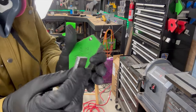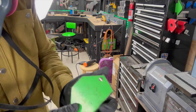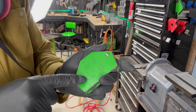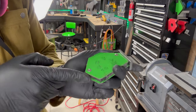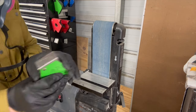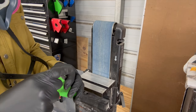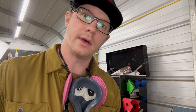Now in order to do a perfect 30 degrees on each of these little pieces, I have this magnetic square that has different angles on it. This face and this face together equal 30 degrees, as you can see right there. So what I do is I put the flat bar piece there and then I slide this bottom edge along my stand over here — just go back and forth — and what that does is put a 30-degree angle on either side of this. Then I keep checking it with the calipers until I get the correct distance as well as correct angles on either side. It's a lot of work to get this shape, so I probably won't do a project like this again, but I started it and I'm going to finish it up.